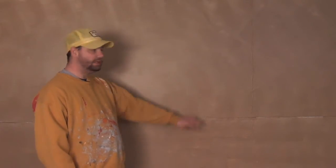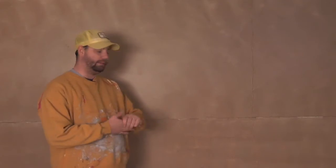The reason you're going to want to do a decorative painting technique is to kind of liven up a room, to give it some life, to make a boring, flat, plain wall pop a little bit more and be a little more interesting. You can see here that I've laid down just a simple base coat — this is kind of a medium brown color. What I'm going to do now is lay on top a top coat, or another color, that's going to contrast with the base coat. All three of the techniques I'm going to use today are going to take advantage of the base coat coming through the top coat. So it's very important when you're selecting your colors that you pick two colors that are going to complement each other and not fight against each other.